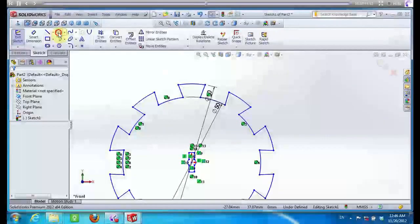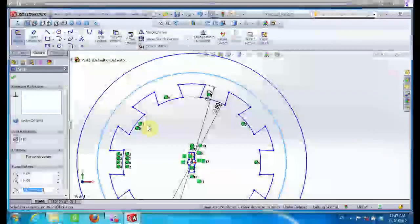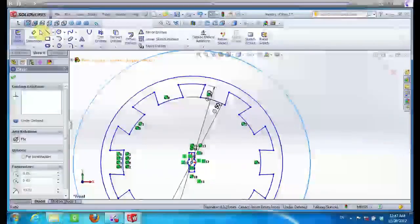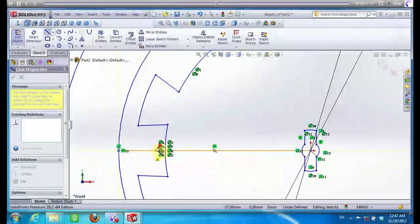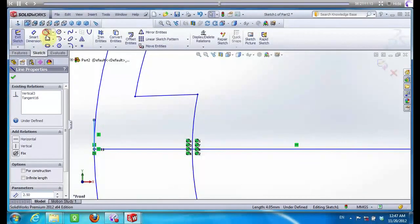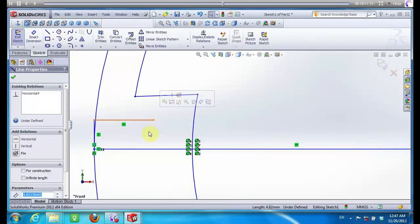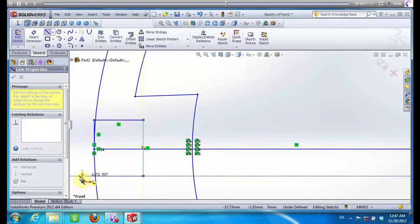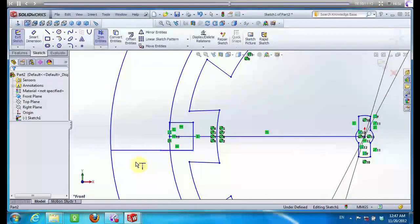Now create this circle, one more circle, on this circle put 33 millimeters and on this 43 millimeters. Now create this line, one vertical line, put 2.5 millimeters, create this line, put 4 millimeters, create this line and this line. Here put 5 millimeters. Now choose extend, click on this line,